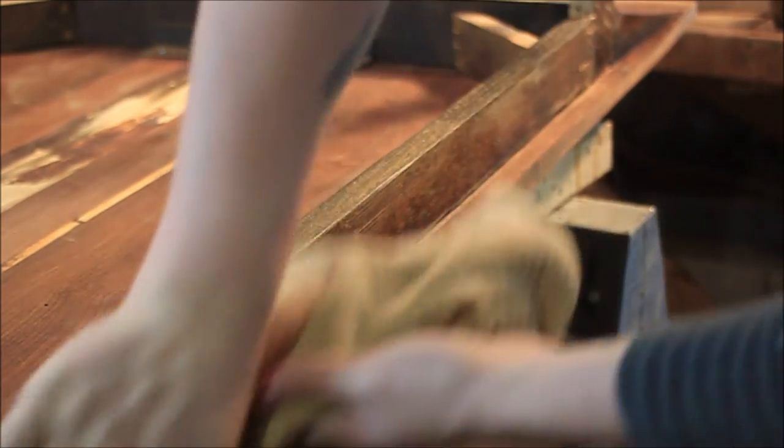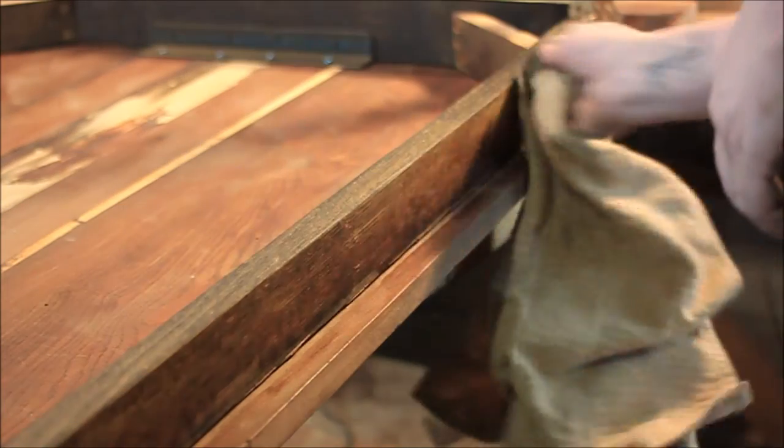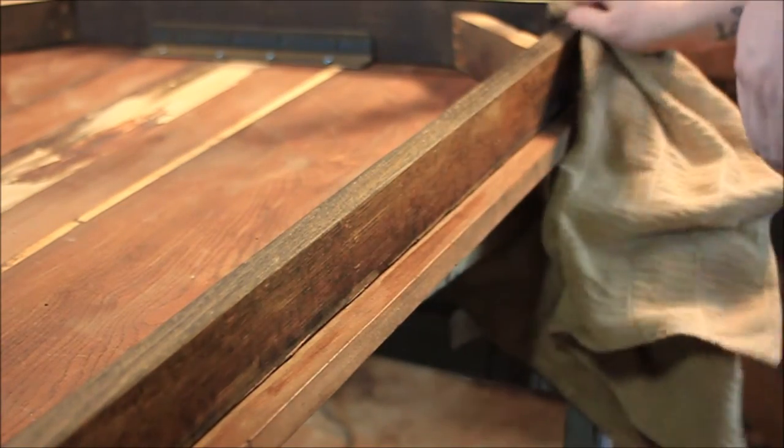To put the patina back on the white oak I used a solution of vinegar with steel wool floating in it for about a week — two weeks I left it in there so it was nice and potent. You dip a rag in it and you wipe it on the wood and it does this. Most people refer to the process as ebonizing the wood. I could tell you the science behind it if I looked it up, but I just want to watch the pretty pretty wood turn pretty pretty black.